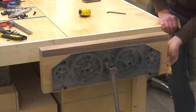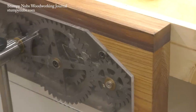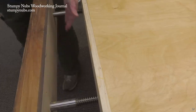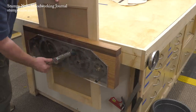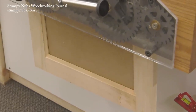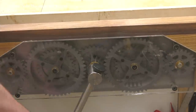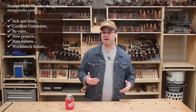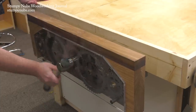By now many of you have probably figured out what Pete's building — it's Andy Klein's awesome Twin Turbo Vice. Andy is a YouTuber and tool inventor, and this vice is maybe his best work to date. It not only looks awesome, it also includes some extremely useful features. The twin screw design gives you a wide jaw with plenty of space in the middle, so you can let your workpiece protrude down towards the floor without hitting a screw that might be in the center of a standard vice. This is great for dovetailing, especially with wider panels. It's not the first twin screw vice ever made, but it's unique in that it uses meshing gears instead of sprockets and a chain to keep the two screws in sync and the jaw parallel to the bench top as you open and close it. This prevents some of the misalignment issues some have had with other twin screw vices.